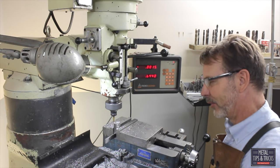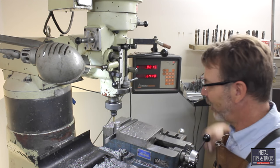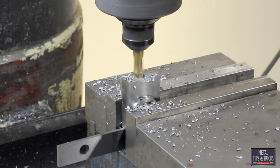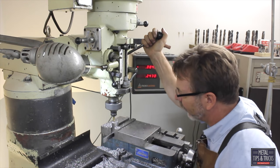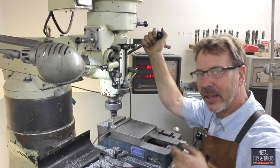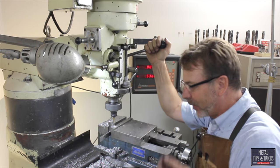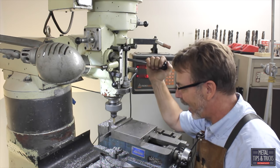There are a couple of ways to actually make this slot. With an end mill I can cut through, or I can do plunge cuts — and plunge cuts are faster. The trick to plunge cuts is not taking a plunge cut the full diameter of your cutter. You only want to use about a third of it, because that is where the end of it is moving the most. If you are at the very center it is hardly rotating, so it is not going to cut much and you will just battle it.